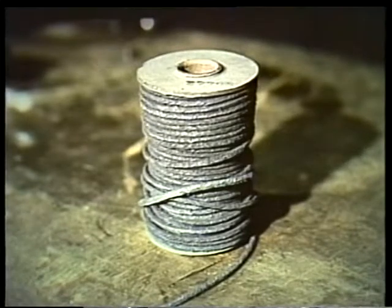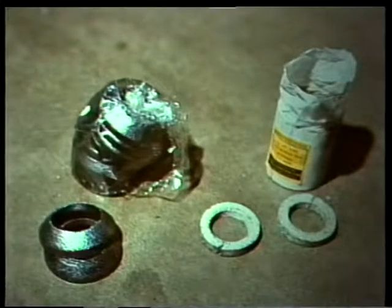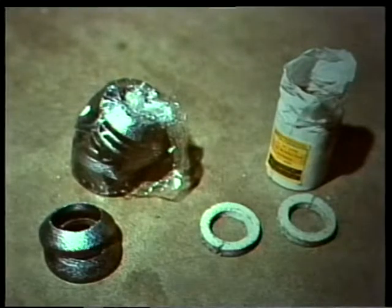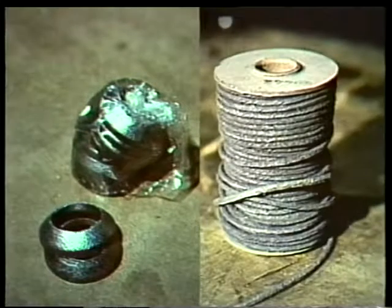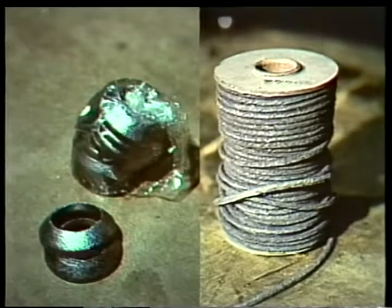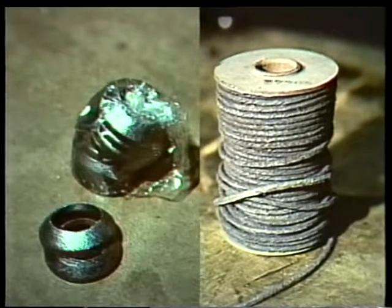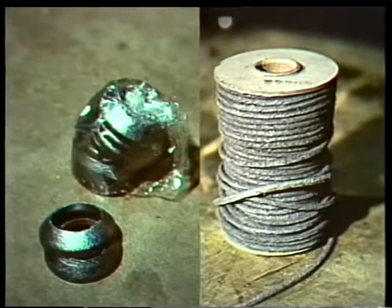Packing usually comes in two ways, either in bulk form on a spool or roll that can be cut and fit to the size needed, or in various pre-cut sizes. With pre-cut packing, the correct size and number of rings are provided and can be fit around the stem and into the stuffing box. Both types are preformed, that is, made to be the same shape as the stuffing box, whether it is round or square. Obviously, pre-cut packing saves time, but it is more expensive than bulk packing.